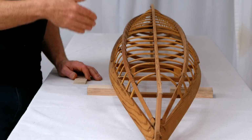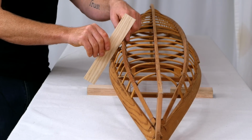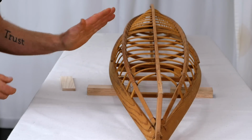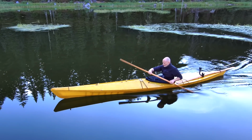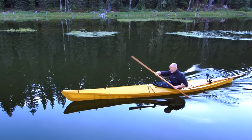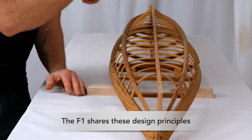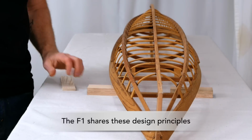And then taking a look at this shape from the back of the boat, once again, you can see that flare angle towards the back of the cockpit. And then as far as how water is transitioning over this shape, once again, by slowly introducing the volume of the boat to the water, we're not driving a bigger bow wave, but we're also not prematurely activating any more turbulence than we have to, which gives a slight advantage for overall efficiency.